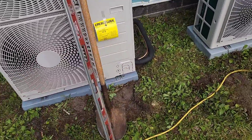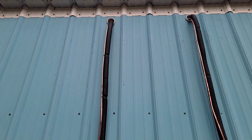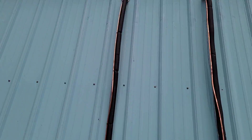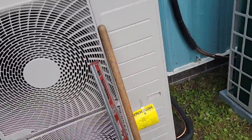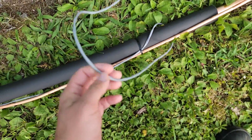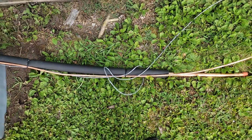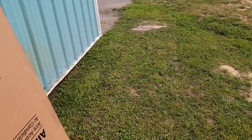I'm going to show you the indoor. That looks good. Probably not going to do line-hide cover on this job — probably just going to seal it up. I've got some two-inch two-hole clamps to hold the line sets to the wall. And then this is the signal cable — that's the control wiring, two-wire from each condenser to the air handling control unit.